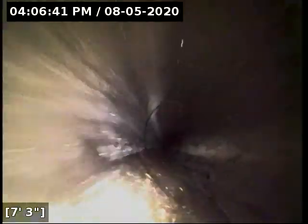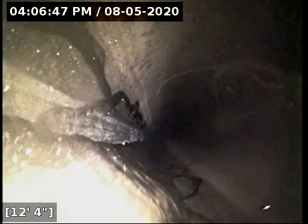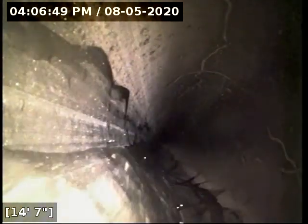it. There is a secondary cleanout outside under a valve cover box, which needs to get a cap put on it. It's got a valve cover box lid on top of it. The problem is it's a 4-inch wide cleanout. If you open that thing up wrong, the entire front of the house is covered in 3, 4, 5-inch wide rocks. If one of those things goes down your sewer line, you're not cleaning it out of there. You're going to have to dig the sewer line up to remove them.